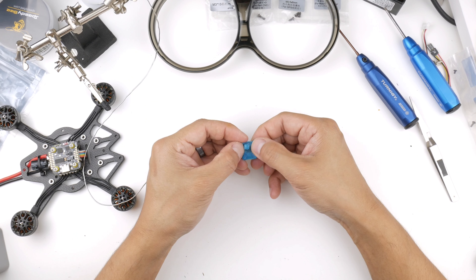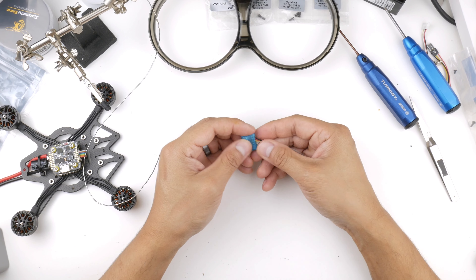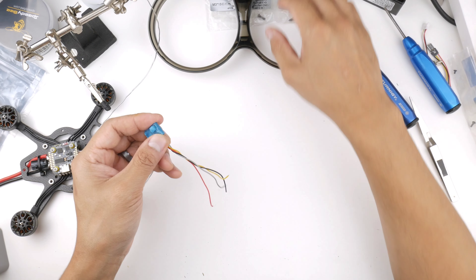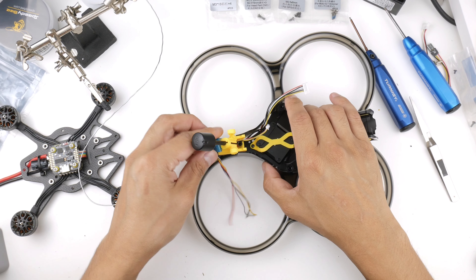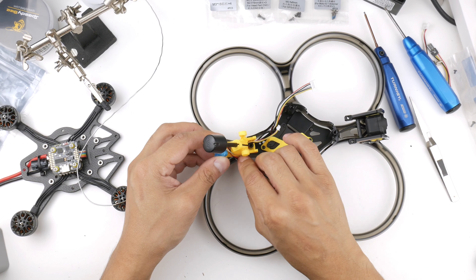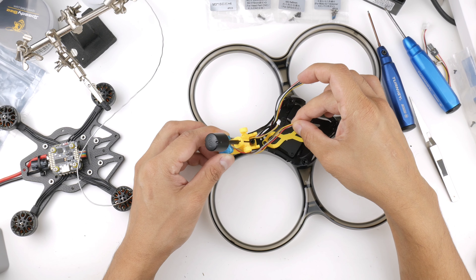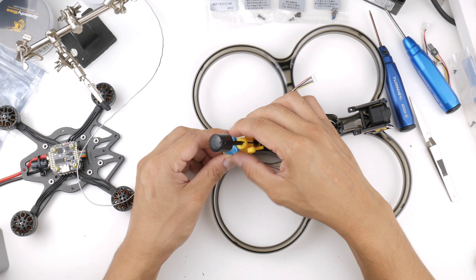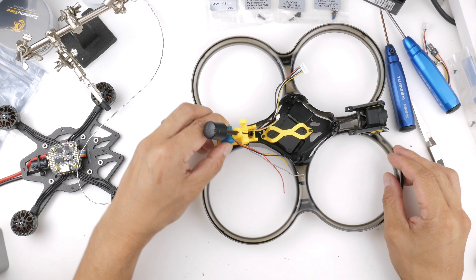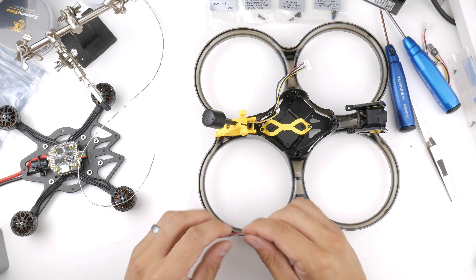I don't think the TPU cover alone is strong enough to handle crashes or knocks, so I'll heat shrink over it and mount it at the back. I'll mount it with the wires passing through underneath — hopefully long enough to reach the flight controller. I'll zip tie it down snug to the TPU. A trick I used was feeding all four EP2 wires into a long heat shrink tube to thread them through the gap.